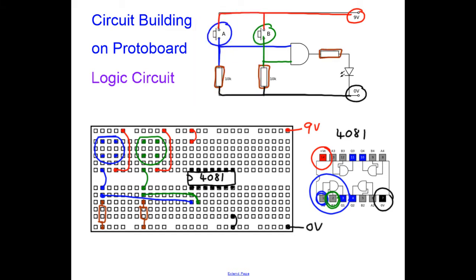My resistor is connected to the output, which is pin 3. Connect the resistor sideways across the board — remember you're allowed to connect things sideways — to just a random spare track not connected to anything else. Then put a green LED in; the LED has a flat bit which is the negative, one leg goes to 0V and the other leg connects into the protoboard. The LED and resistor are connected together because they're vertically above each other in the track. That is my logic circuit fully designed.